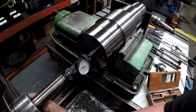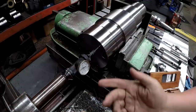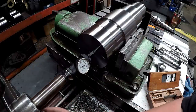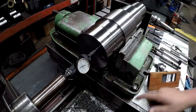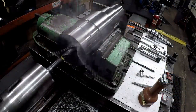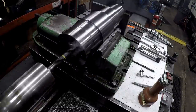The spindle's got a little bit of movement in it. You can see right there. So once I get this within 1/1000ths, I just call it good. We're there. In other cases, we'll stick an indicator on the chuck here and sweep it in with a test indicator. I'm using the reamer size drill first on this second hole.